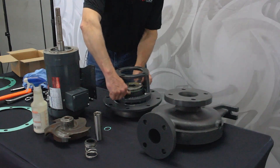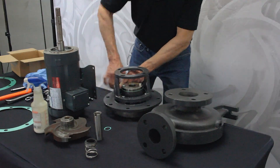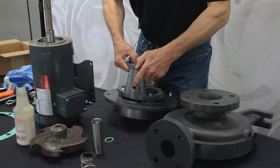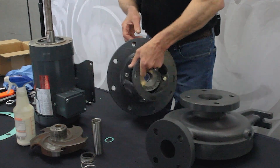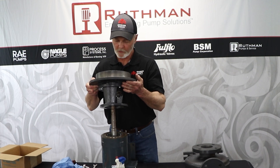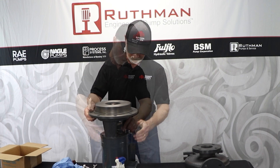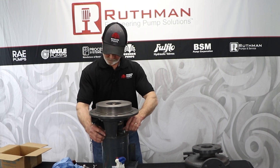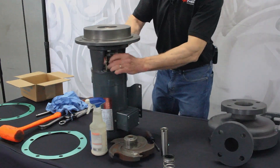In the shop we use pneumatic tools. Notice this hole in the stem should go towards the motor feet — it's a drain hole in case your seal leaks. Some people pipe it away, some don't. So you want to put that facing you if the motor feet are facing you. Put your bolts back in the motor. Generally we only tighten two when we're building them so we can level it afterwards, then tighten all four.